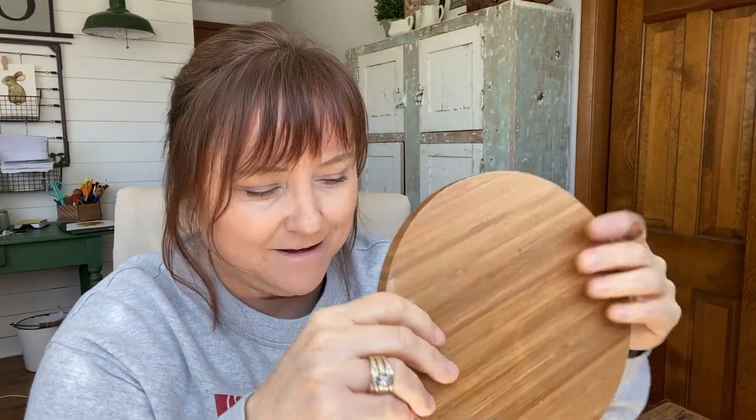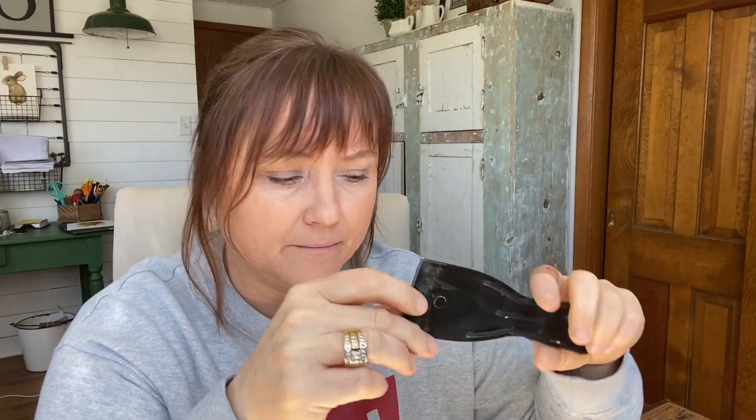I have my notes here on what the difference is between them both. My tried and true that I've been using forever on all of my furniture projects and some wood home decor projects is the Dixie Belle mud. I will leave links to both of these in the description. This mud comes in three different colors: black, brown, and white. I've used it for years on all of my furniture flipping projects. It's great for filling in veneer when you have veneer missing, and for scratches, gouges, screw holes, and nail holes. I use it when I'm painting a piece — put it on, sand it, and then it's ready for paint. I have this piece that broke off of a garbage can to show you the difference between these two wood fillers.